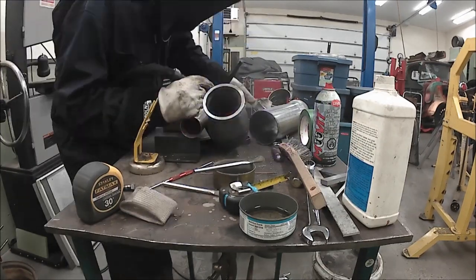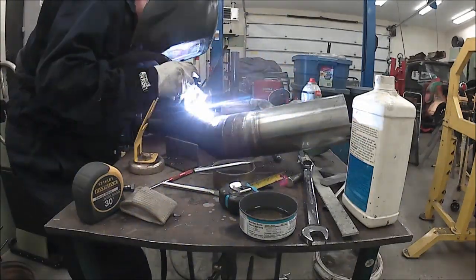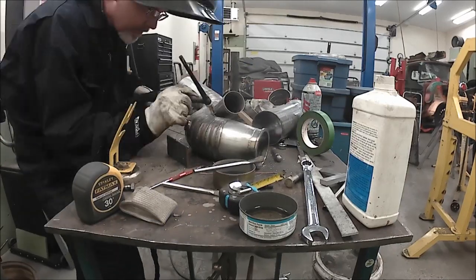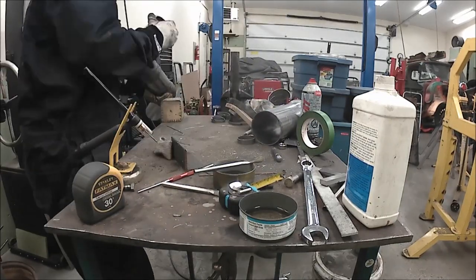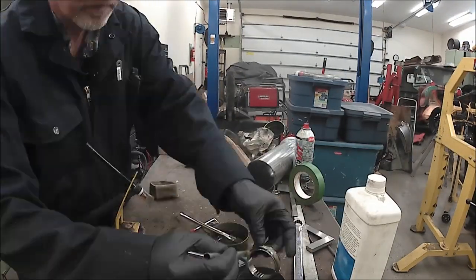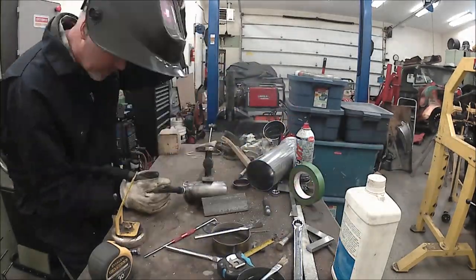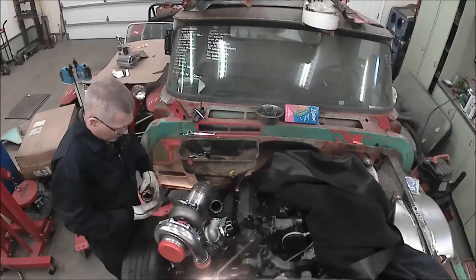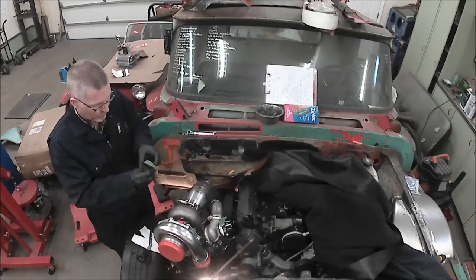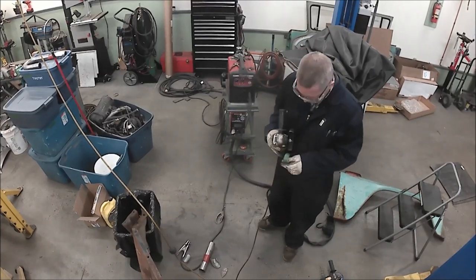The wastegate dumps back into the downpipe of the exhaust. And because stuff moves when you weld it, I welded everything up and clamped it, hooked up the wastegate and clamped it, made the connection from the wastegate to most of the way of the downpipe, and then welded the last bit together while it was all on the truck. That way, all of its warping and moving and changing when I'm not looking is done. And then I can just cut a piece that just fits, weld it in place,